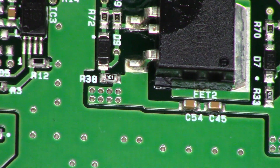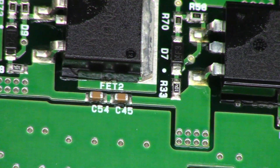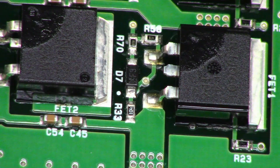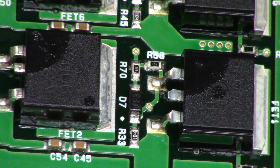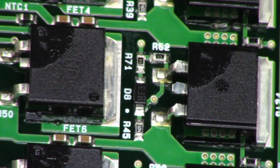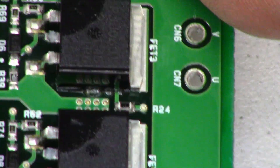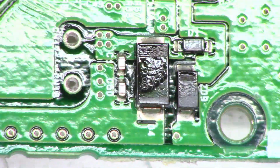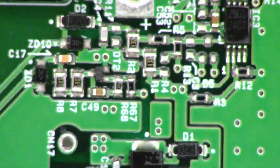There's a 104, so that would be 100K — a 100K resistor. Another 100K. F3 diode. A 470 resistor and a 100 ohm resistor right there. Probably all the same over here. Hopefully if someone's trying to repair one of these things one of these days, maybe some of these part numbers might be helpful to them.